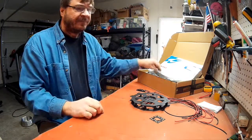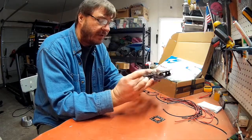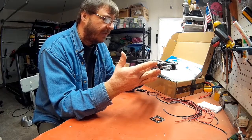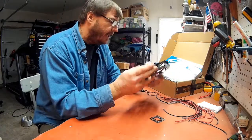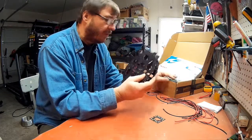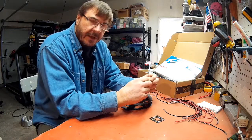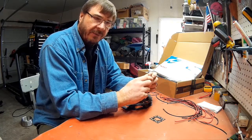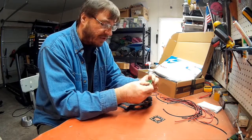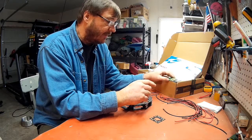So I'm going to get started here. I'm either going to build the landing gear first — it's up and ready to be worked on and I don't think it'll interfere with anything else. Then I have to solder up my wiring harness, but before I do that I'm going to do some basic wiring, do a throttle calibration on my ESCs, and make one single programming change on my ESCs. So let's get down to it and see how this goes.